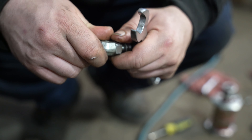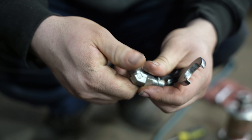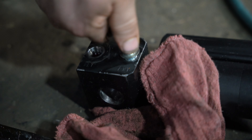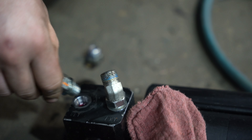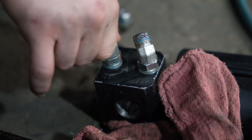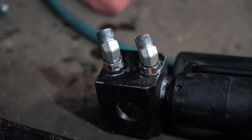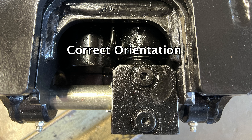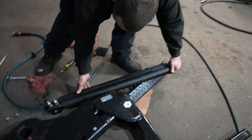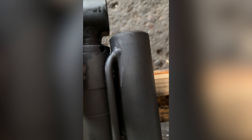These fittings are still new, so we're going to reuse them. If they were old, I'd probably change them out, but they're new, so we're going to reinstall those on the new cylinder. You want to try and have them cocked towards this way — it helps keep our lines from rubbing. Those are all nice and tight. After you get the fittings tight and pointed the proper way, you want to make sure that the block is on the left tube in the back, and this is on the right side.